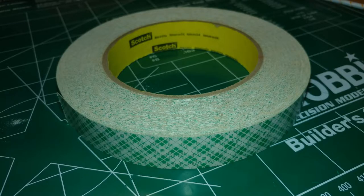Next is holding strategy. There are a lot of ways to hold down material when you're going to be milling it. In this case, in the simple exercise that I'm doing, I'm using 3M Scotch 410M double-sided pressure-sensitive self-adhesive tissue tape, and I'll be taping it directly to a wooden waste board. There's a link below in the description of this video if you want to buy this tape.